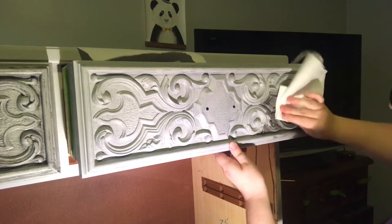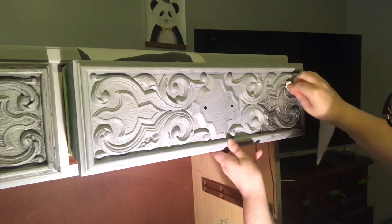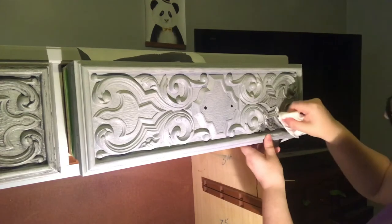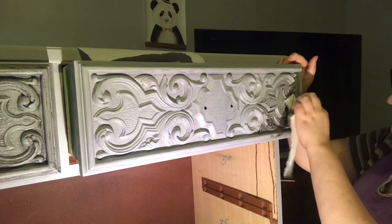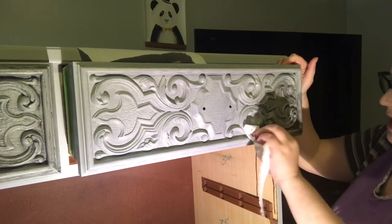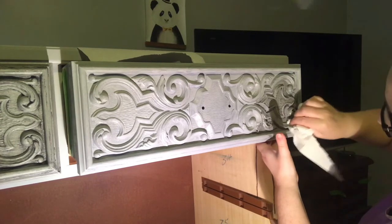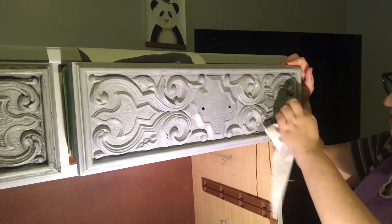Paper towel works best for this. All you're going to do is rub it back — remove as much of that excess as you can. You want to leave a bit; it's almost like you're buffing wax, just start rubbing. See how much lighter that's getting already? I'm just removing that excess. If you don't apply the clear glaze first, the charcoal will be almost impossible to remove because it will just soak into that paint so fast. I personally find it's much easier to apply glaze this way. I've used glaze before on raw timber and it gives a beautiful effect, just adds to the grain more than anything.